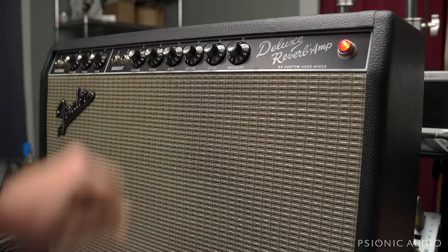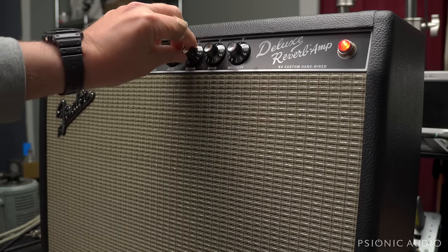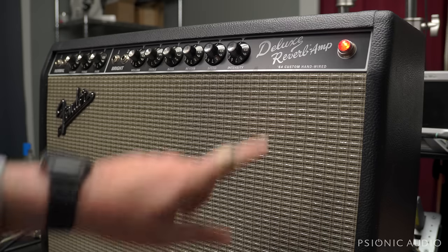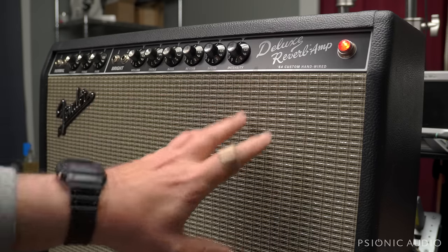So we're going to take this out, and we're going to check this problem out with the crackle and pops on the volume, and see if we can get rid of the hum in the reverb. And open up his stock tank and see if it's fixable or worth fixing. If it's one of the Beltons that they use, better to put in a better quality tank. But it shouldn't be anything too bad. But for the price these things cost, you shouldn't have any of these issues.